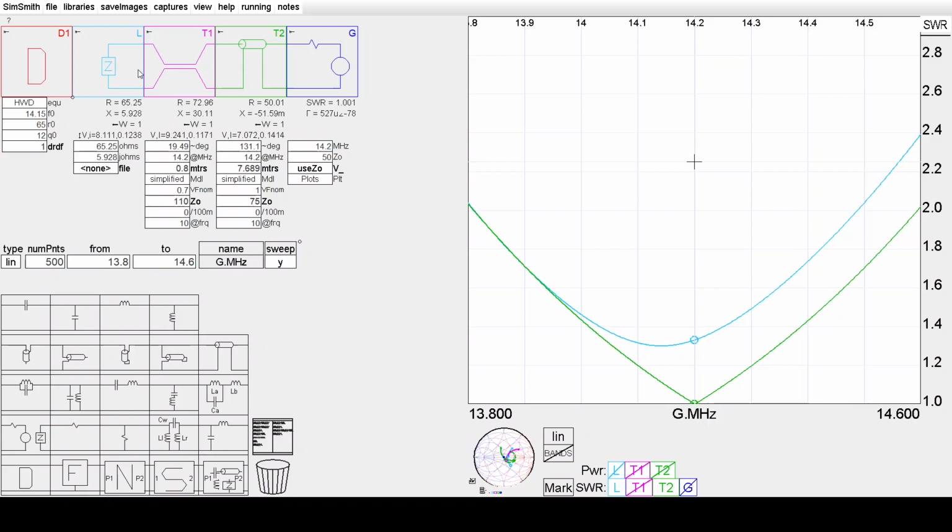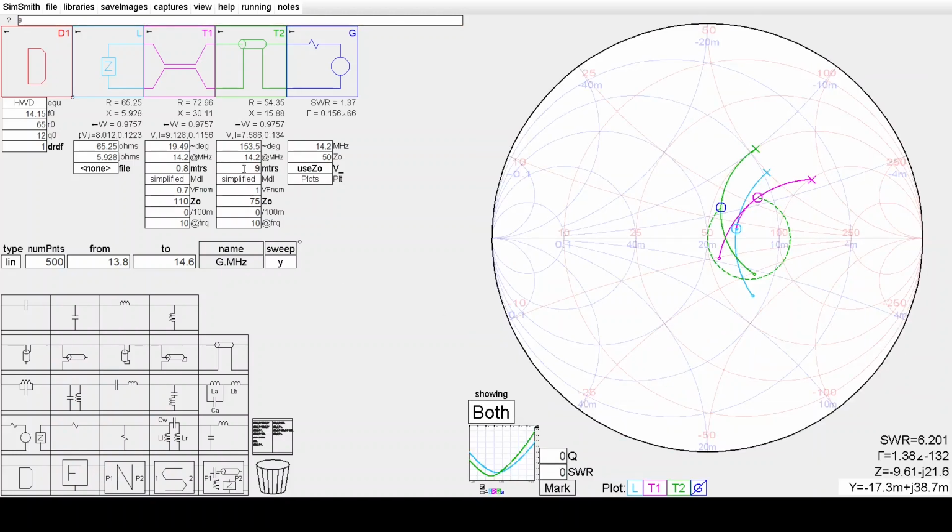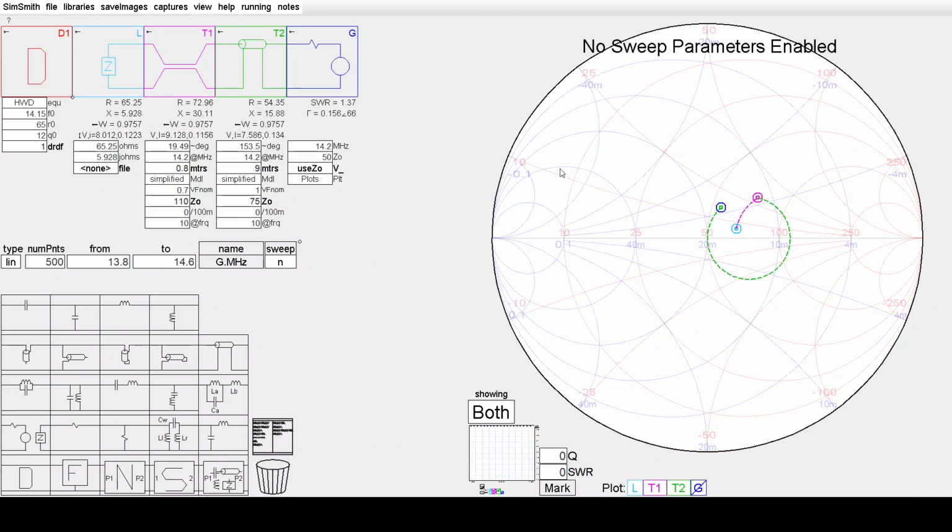You'd put the dipole up, you'd measure and model the actual balun you're going to use. Let's change this out to, say, 9 metres long. You'd initially build it with too long a piece of 75 ohm cable. We'll turn the sweep off. So you build it with too long a piece of cable, and you would look at the VSWR looking into the 75 ohm line. So looking in here, you'd be looking at VSWR 75, and you want to set that to about 1.5.